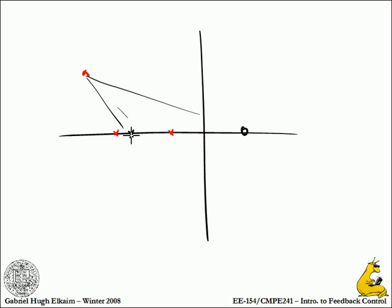And I say, okay, well, let's take it one step farther. And so here are my 2. Here's my desired spot. Put this in here, which gets me another one in here, right? These two are still going to meet my point, right? But does it happen before or after this one goes the other way? The farther away I move this one, the faster this guy's traveling from here to there, right? And therefore, you got to be careful about this. You have a degree of freedom, right, of where to slide this along, but that degree of freedom isn't unconstrained at all, right? So you still have a lot of things that are going on.